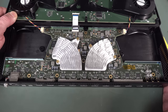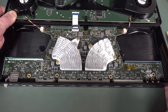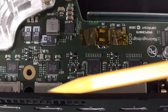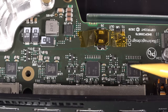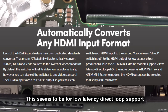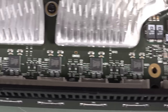By the way, I have heard that Blackmagic has a need for good engineers — hardware, software, firmware, FPGAs, and applications programmers. So if you're interested and have skills in those areas, definitely hit them up. Just like the previous version, this is HDMI input 1, 2, 3, etc. You'll notice that inputs 1 and 2 use different HDMI receivers to the other channels. In the other design it had only one of these and all others were identical, but this one has two. That has to do with unique features for channels 1 and 2 compared to all the others.